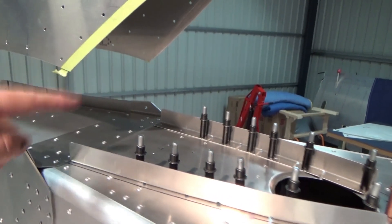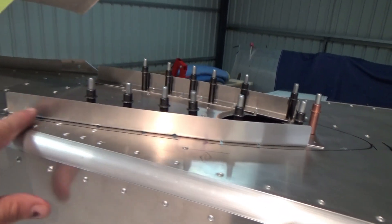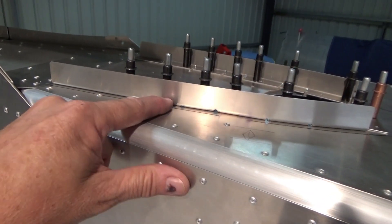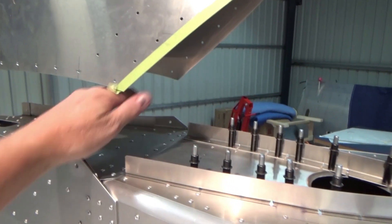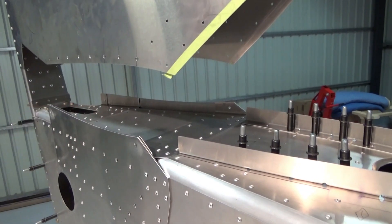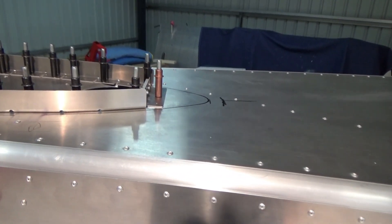I've cut out the slot for the tailplane. Before I drill through the dorsal fin into this — which is one inch wide here — I'll obviously find centre and watch my edge distance because I do have a gap at the bottom there. Also, I'm going to fit the stab because the stab has the potential to move this ever so slightly and throws things out of whack. So: tail back, fin off, stab back on, fin back on — do this, drill those holes.